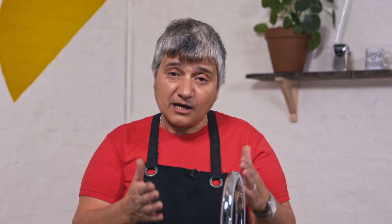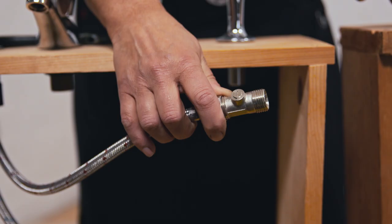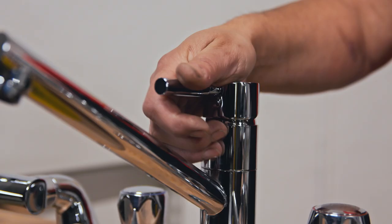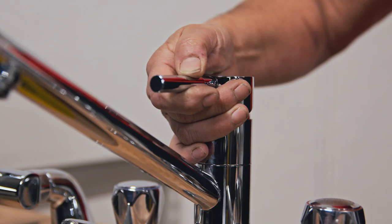A tip here is to leave your taps turned off. Then once you've turned the stop tap on, turn your tap on. Then turn your tap off, get your screwdriver and turn your isolating valves on — by the way, there should be one for hot and for cold. Then slowly lift up your lever and turn your tap on and test both ways. Plumbing can seem intimidating for the best of us, but once you've got the water turned off, there's not that much that can go wrong. Have a go!